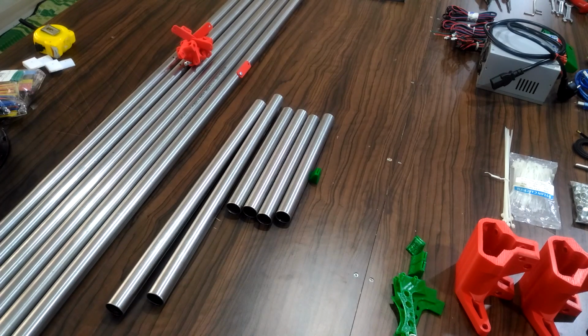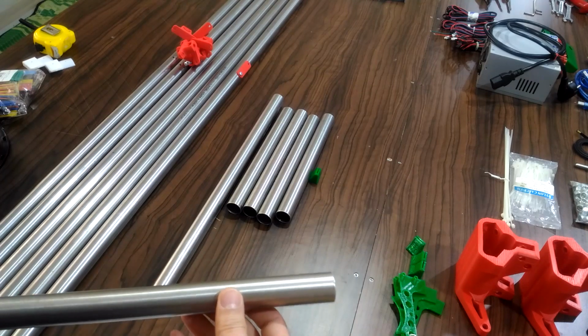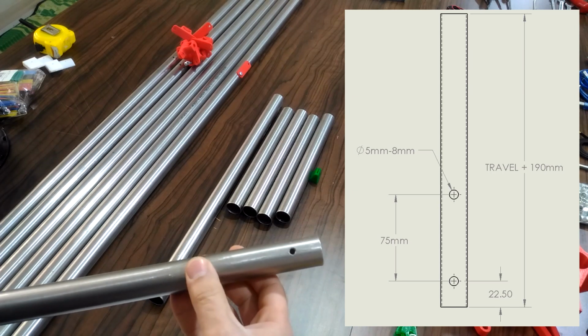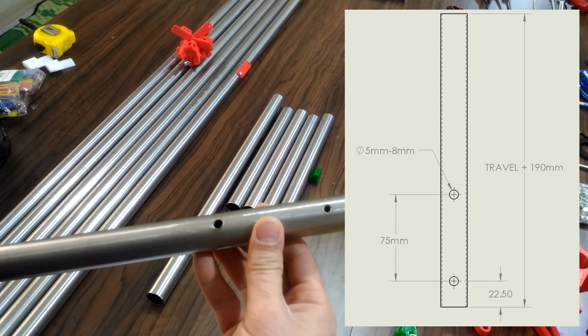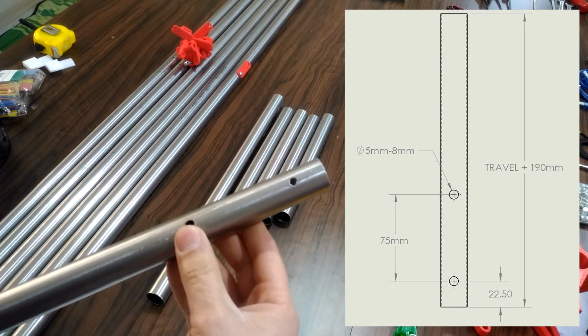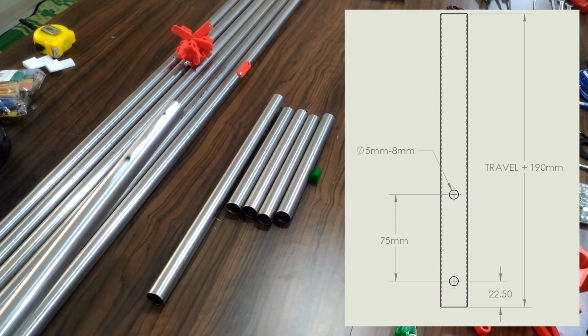The first point, as on the official website of the machine, in the conduit page: for the tubes that will be the Z-axis rails, 2 holes must be drilled in these tubes, as in the following figure, and the diameter of these holes will be from 5 to 8 millimeter. We will use these holes later when installing the tool mount piece.